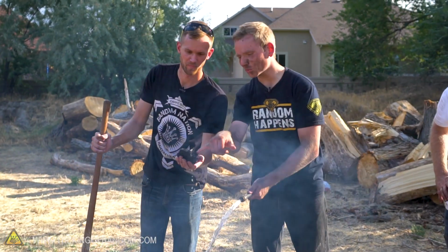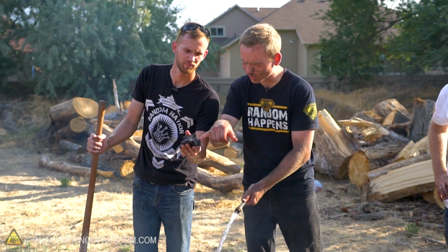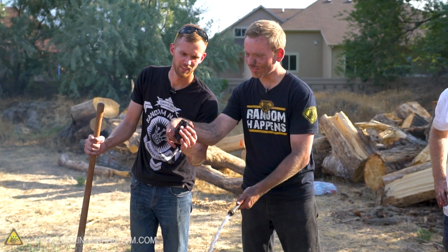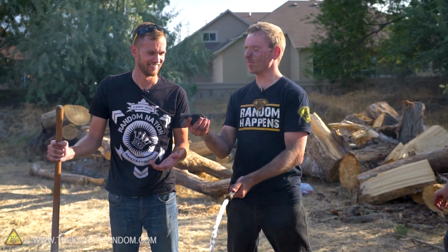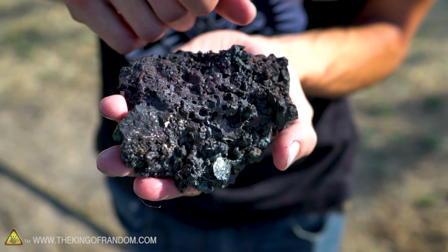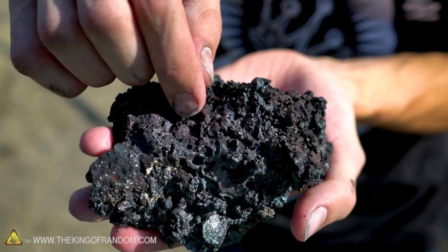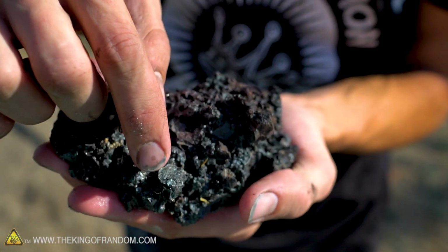Okay, so this purplish red rust that you see up here, that's a really good sign, as is that bluish stuff right there. Like this, and hold it up to the light. So that lump maybe. This is iron! I'm gonna join a heavy metal band because of how awesome this feels. That is so cool. So is there still slag in this, or do you think this is pure iron at this point? This has got tons of slag and probably even some charcoal in it.